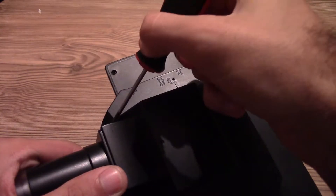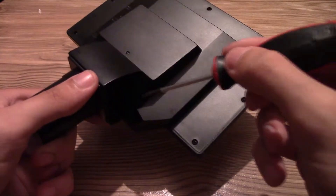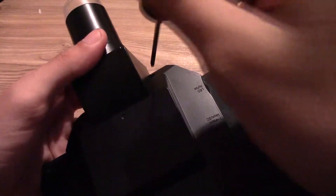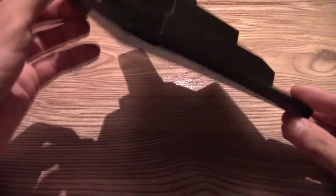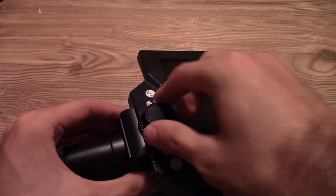To open the microscope you need to remove 9 screws, and I suggest keeping the light diffuser on to protect the LEDs and the lens. After undoing all the bolts, turn the microscope around and pull it from the focusing knob. The top cover should come apart.